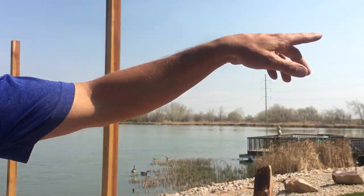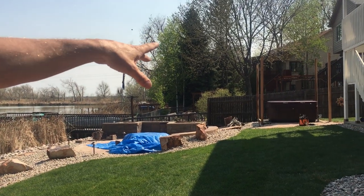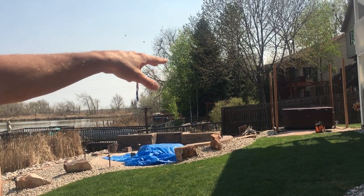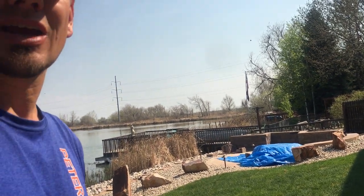Keep in mind that if your hot tub is a 120-volt version, it can convert to a 240-volt version. This is a Jacuzzi J300 series — they did convert it in the shop, and we verified here that it went to 240 volts. If you do it as 120-volt, unfortunately you're not going to be able to run the heater and the pump at the exact same time. Because it's 240-volt rated, you can run both simultaneously. We also pulled 6-gauge wire just to make sure — in case they change to a larger tub — they could go to a 50-amp or even 60-amp. It is 4-wire rated as well, not 3-wire, because your Sundance versions are 3-wire.